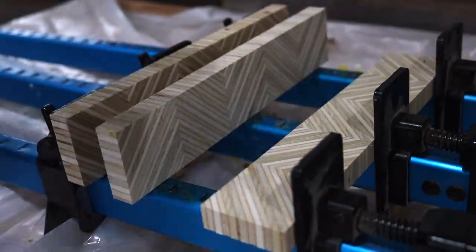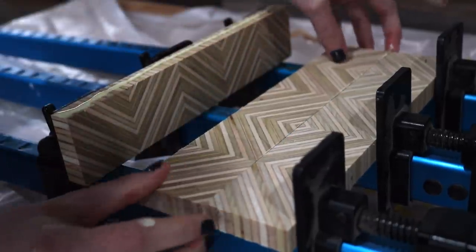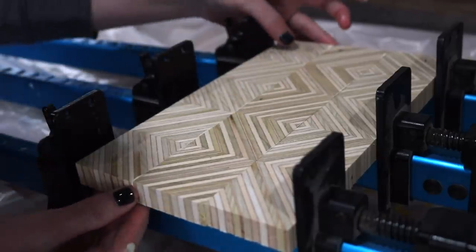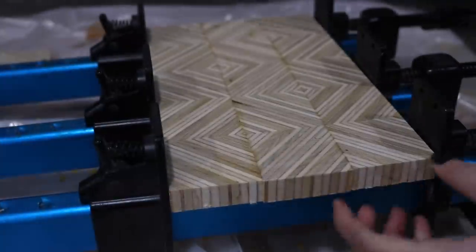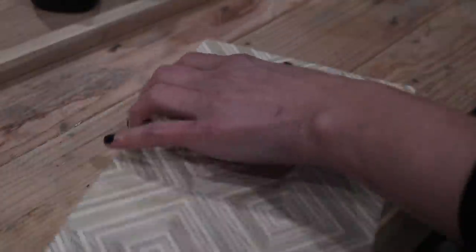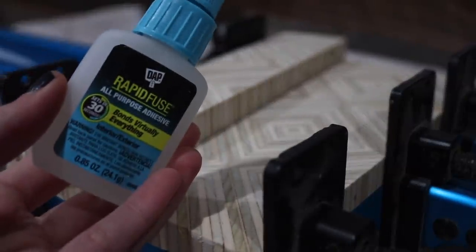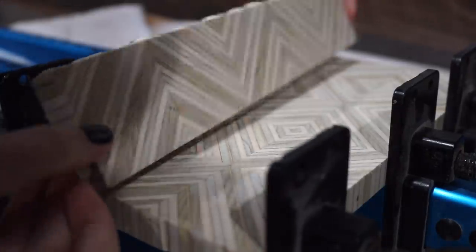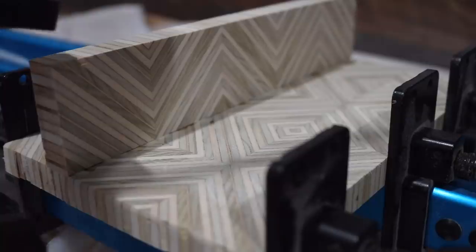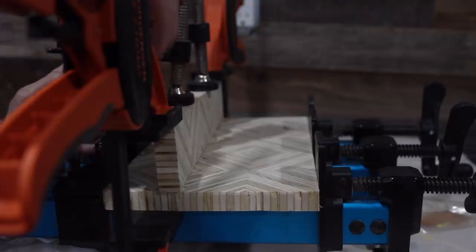With the brainstorm session being a complete success, I brought over all of the pieces to the clamps and began to glue up the backer of what is going to be the key holder. I spent a lot of time here racking my brain, making sure that everything matched up, and then I was able to clamp everything together. Once it was dry I removed it from the clamps, gave it a really light sanding to make way for the shelf which I was going to be gluing on next. To help align the shelf while matching up the patterns and to prevent it from slipping around when I put the clamps on, I used a little bit of rapid fuse as well as wood glue. The rapid fuse worked as a temporary clamp so the piece didn't slide around, and then I was able to clamp the actual shelf to the piece with the wood glue as well and let that dry overnight. My goal was for it to look like a continuous pattern from the top of the piece to the shelf itself, and it worked out beautifully.